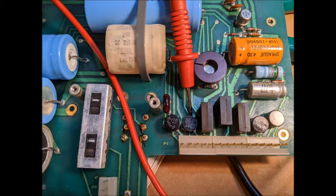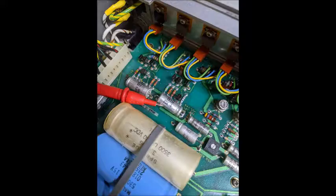It's a bridge diode, which means it has four diodes inside the encasement. Also on further investigation, I found out that one of the capacitors — a 10 microfarad capacitor — was shorted, so that needed to be replaced also.